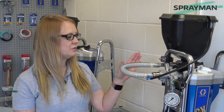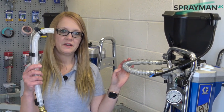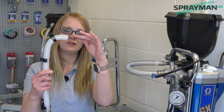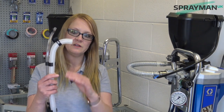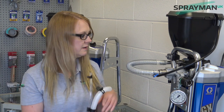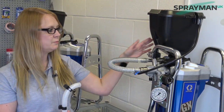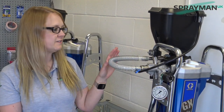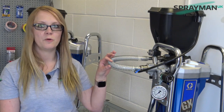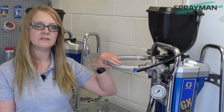We have got a Sprayman UK video on how to change between modes and I will pop a link in the description. The GX21FF has this feed tube. There seems to be some confusion out there between a feed and siphon fed. This is a siphon fed tube — it will always contain a volume of liquid and it must maintain that volume of paint, so this volume of paint will never be used. This is a feed tube, which means any liquid that goes into the hopper will feed straight through the hopper, through the feed tube and straight into the pump. Effectively, we're increasing the capacity of the hopper by around 100ml or so and there is absolutely no wasted paint within this tube.